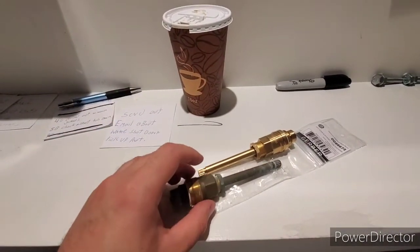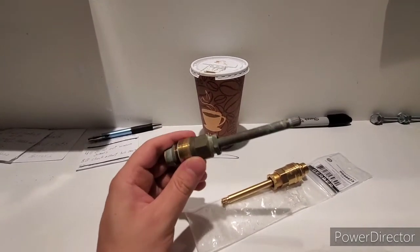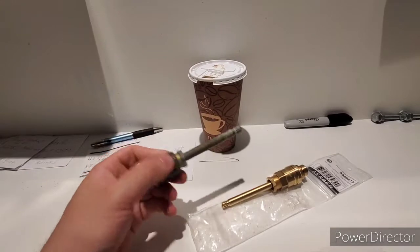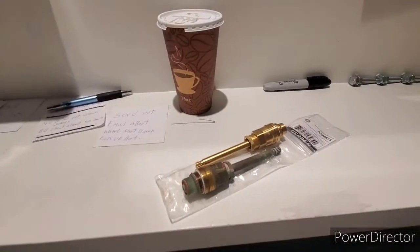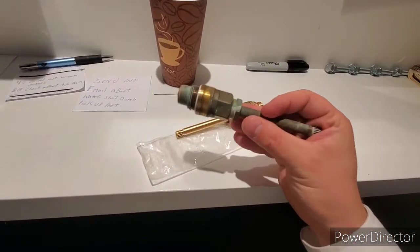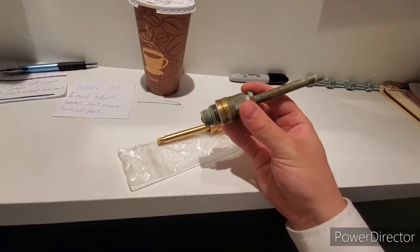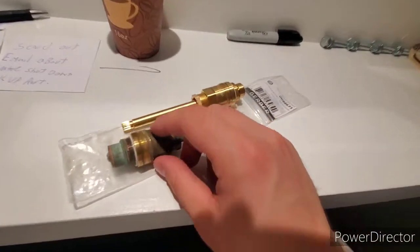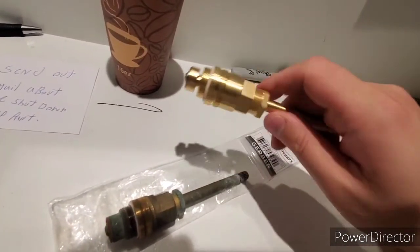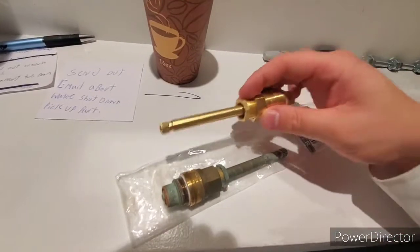One of them is leaking because I had to change out one of these last week in an apartment — the diverter one, to go from tub to shower. I had to put the one under the sink off to shut water off to the bathroom so I could change it out, and then it was leaking. I tried to tighten the packing nut, couldn't tighten it, and when that happens you just got to change it out. These are a little expensive — $25 a pop. I have the new one right here. It's just a very simple valve — just a washer — you turn it in and it goes up against the seat and shuts.